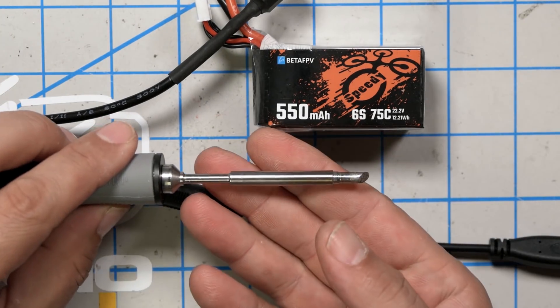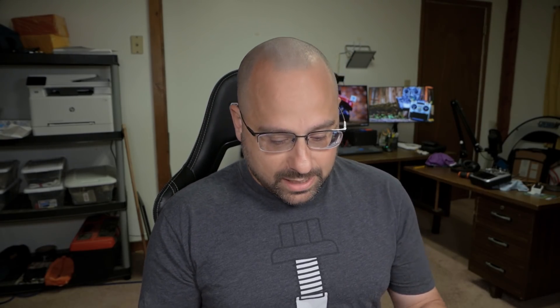I strongly recommend using the highest voltage battery that you can. These guys are slow to heat up, but they will get the job done. I've soldered XT60s with it on a 4S battery, but you'll want to make sure you're using the heavier tip if you're doing big heavy 12-gauge or 14-gauge wire on an XT60. Whereas if you use 6S, they're pretty snappy and powerful, and it's just a much better experience overall. For those of you using 6S flight packs, this is a no-brainer. If you're on 4S but have a 6S lying around, you might want to use it, or you can get the job done on 4S — it's just going to be a little bit slower. And by the way, everything I just said is 100% true about the legit TS-100, which is the gold standard for portable soldering irons.